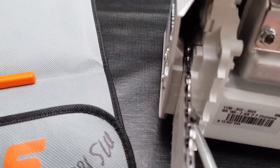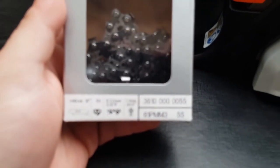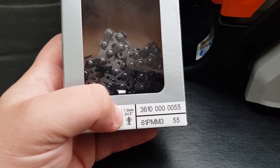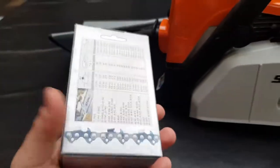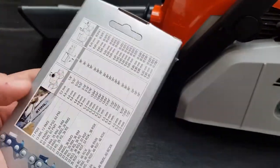Underneath the front here we have a tensioner. So you would use that and turn it clockwise to tighten the chain here. It's a 40cm 16 inch 55. It's 9.32mm, 3/8. It's 1.1mm. These chains are pre-heat stretched as well. So you can put the chain on there and it's already pretty much stretched to its maximum length and heat treated.